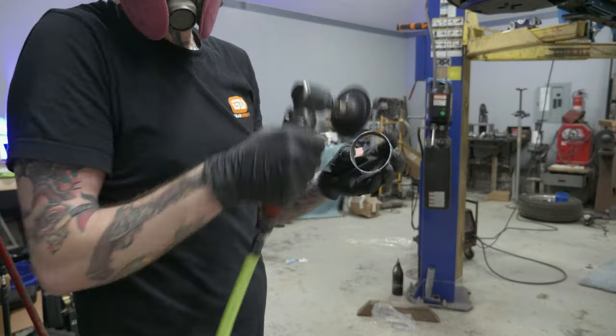My dad actually took it upon himself to go ahead and weld out the entire exhaust. He took it all apart, took his time doing what I told him — taking it easy and slow — welded it back together, then painted it and put it back in the truck. We did choose mild steel on this build. For most builds I do, I find that is sufficient. The additional cost of stainless adds up quickly, and the additional work required in TIG welding and back purging to do it properly — if you're not back purging it, you might as well just be doing mild steel anyway.